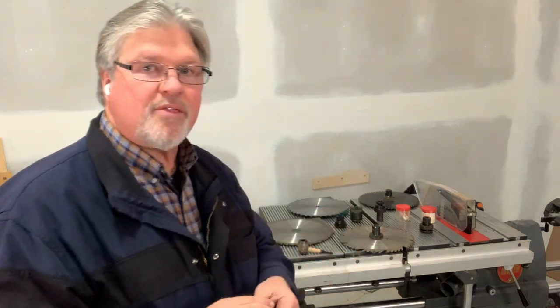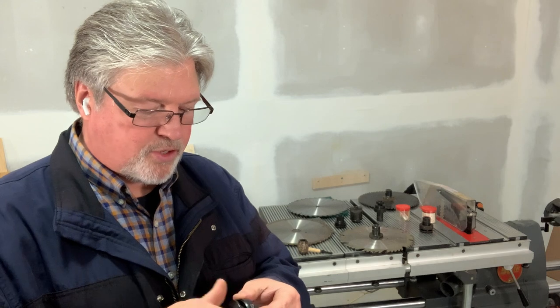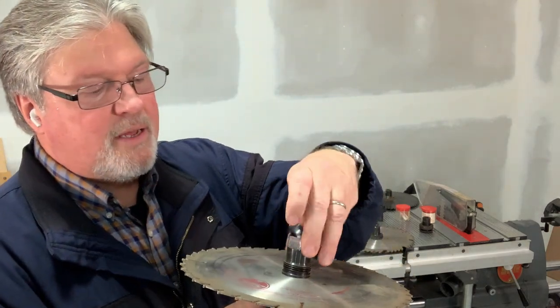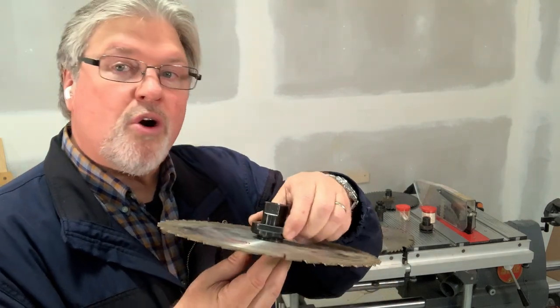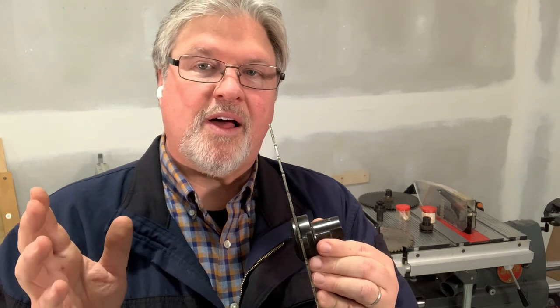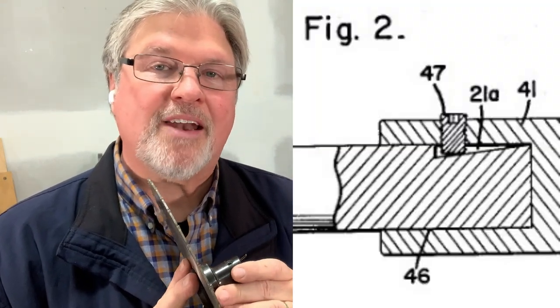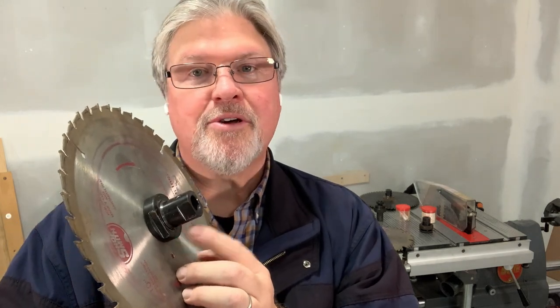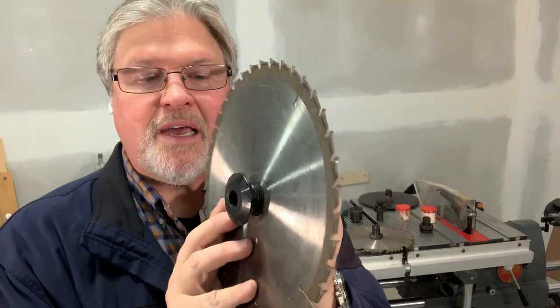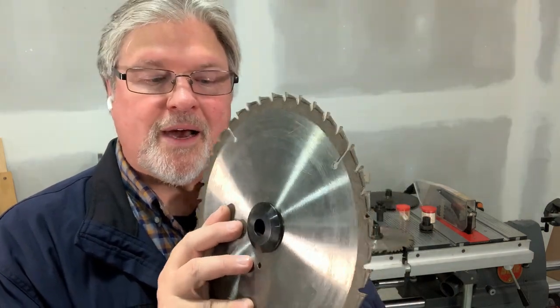Both of these will hold a saw blade with an inch and a quarter arbor. I'm going to pull the nut off of this one and pass it through the blade. The nut goes on the back side — this is the side that will go against the headstock. One concern that was raised recently was the blade could come flying off. Well, if that set screw were to come loose, even ever so slightly, it can't come off because it wedges on the tapered flat of the spindle. If you're using your lower saw guard, it would also be captured. But another concern is, what if that nut were to become loose? If that nut were to become totally loose, the nut would move towards the headstock, the blade would move towards the headstock, and everything would still be captured on the arbor. With this design, you never, ever, ever are going to worry about the blade coming off.